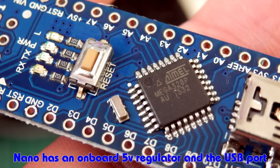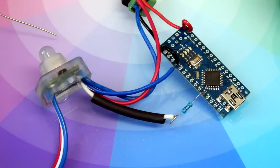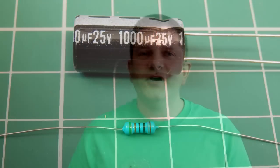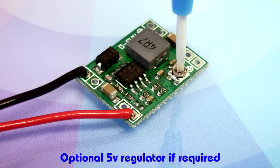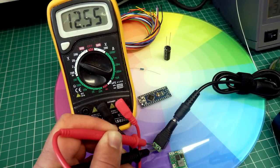We ended up using a little Arduino Nano. We were going to use the Micro, but the Nano is a little bit easier because it's got a USB port on it. To set this up you need a small Arduino board and a resistor on the very first pixel of the NeoPixel strip — around 500 ohms — which just protects against transients going into the data line. Then you connect the NeoPixel's positive voltage, usually 5 or 12 volts depending on the type you buy, and ground it. The schematic is very simple and you'll be able to see it from the photographs I put up.